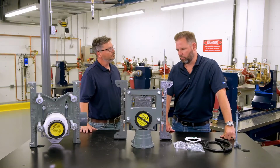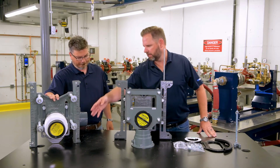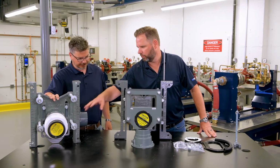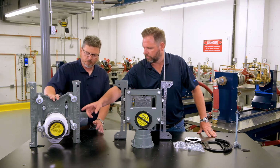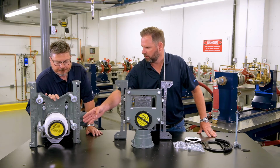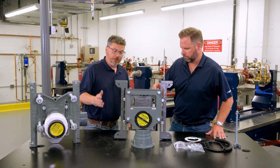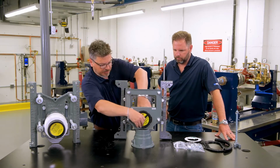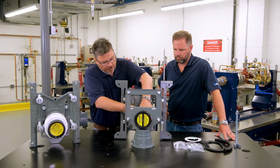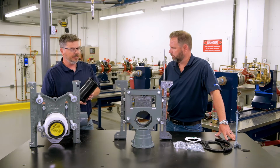Exactly. Moving forward, we have the old traditional style with compression, right? And we had a safety foam guard on this one, for debris falling on there. And it looks like we used to adjust that ABS nipple down with a chop saw. Correct. Is that a similar function on the QT as well? Yes, we use the same standard 8-inch ABS nipple, which comes standard. We do offer longer nipples. We can go out to 24-inch nipples if needed.